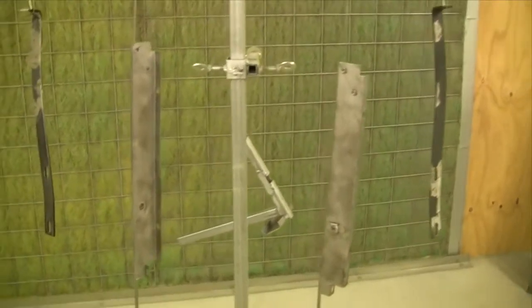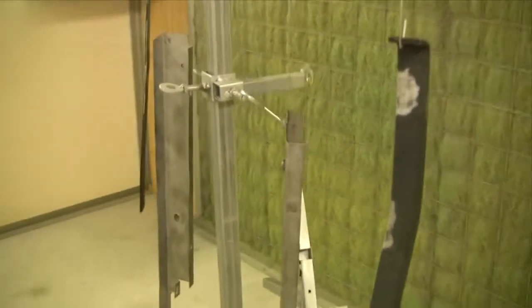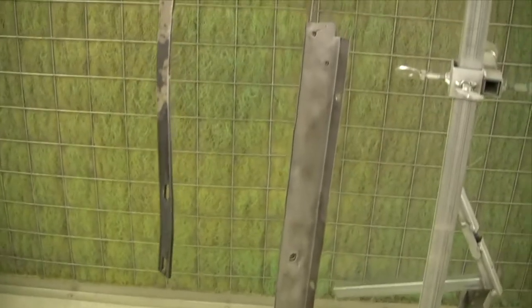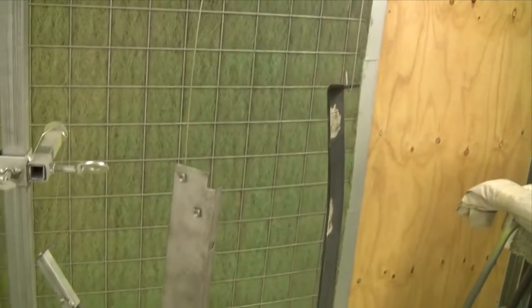There's the tree of bumper bar parts, all ready to go. I'll give them an etch, then a top coat of 2-pack satin black that I've got here. No need for undercoat. I've painted 2-pack straight over etch before and it's lasted a very long time.